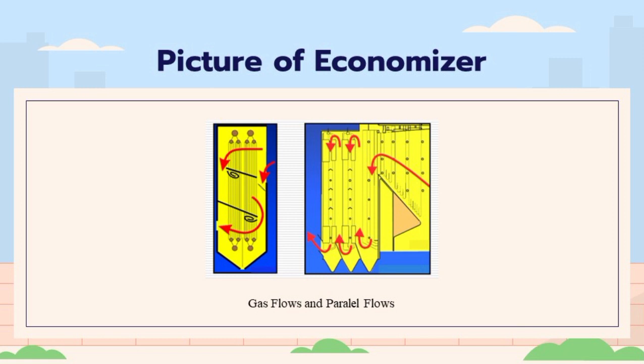Figure 1 to 14. Vertical economizer design spread fast in Scandinavia, where by the mid-1970s, more than half of the recovery boilers had long flow economizers without direct contact evaporator. In competition to purely vertical, the three-pass design featured gas flow which was directed crosswise to the economizer tubes to improve heat transfer. There have been several rounds of economizer header designs.